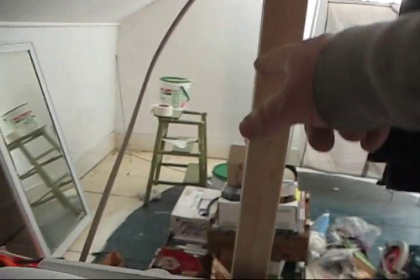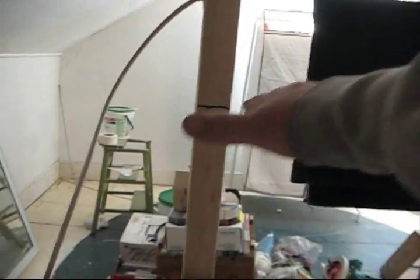Over here, this stud — I'm going to put a board across from here over and from here over and cut this completely out. I'm going to put two more pieces in here so that I can put the medicine cabinet right over the sink on this side.